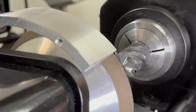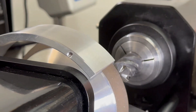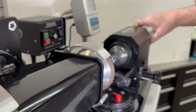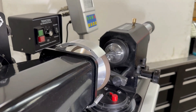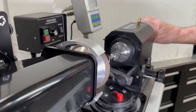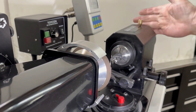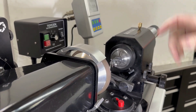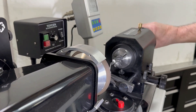This is accomplished by setting the wheel below center and having it tilted at, in this case, about five degrees. Then when you just come across, it's pretty quick. You just load the next flute. We're using the indexing collar on the back of the spindle as a length stop and the tooth rest as the rest.